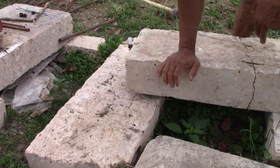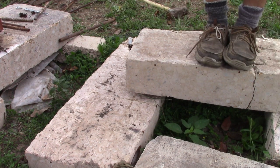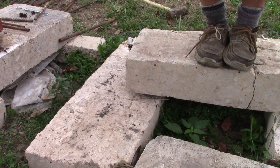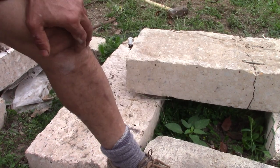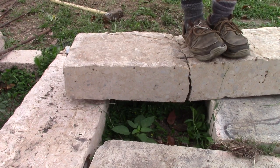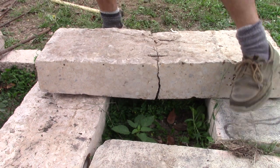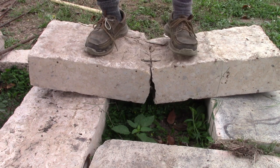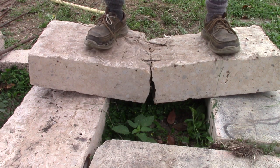As I go back towards its shear point again, if I load here, I'm down this side, right? So, no big deal. If I step on this side, though, now the load's being transferred through this wire, grabbing back here along with the counterweight, if you will. Okay, can't quite see that, can you? Along with the counterweight that's over here. But as you can see, loading in the center is not going to help us, is it? Putting epoxy here would just be useless.